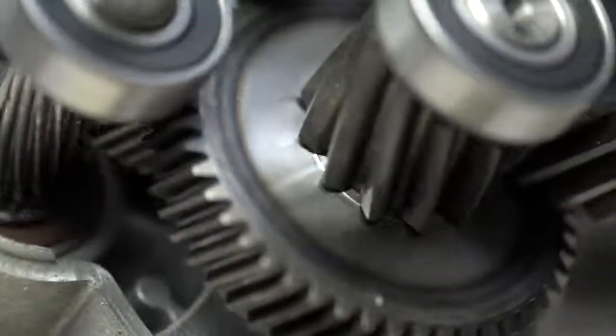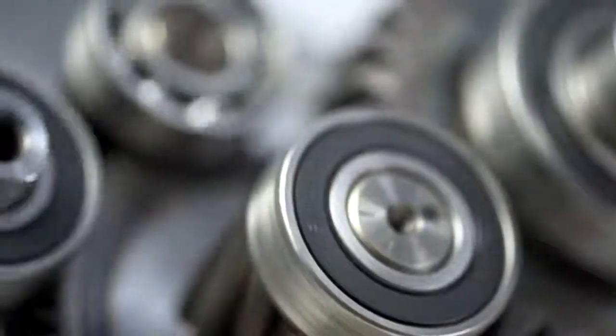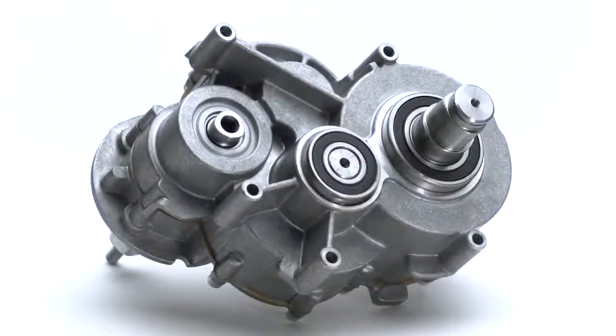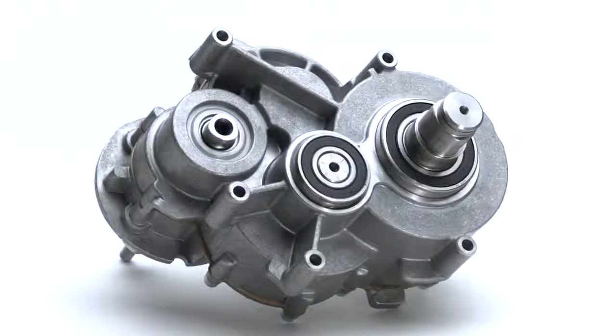The three-stage polygon gear with helical gearing makes the GP quiet in its operation. It has permanent lubrication and is positioned as a black box underneath the cover.